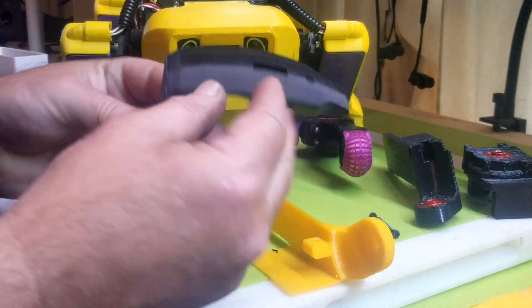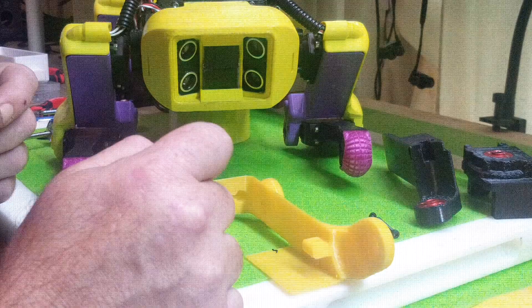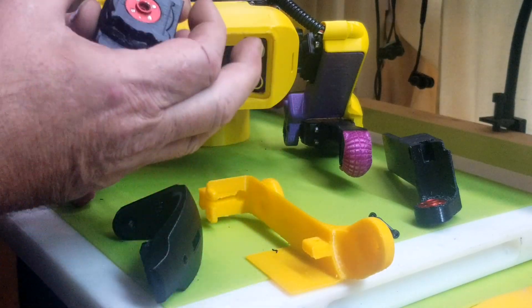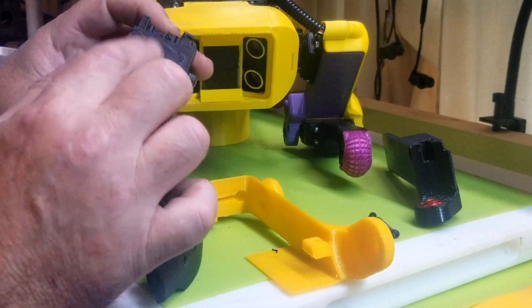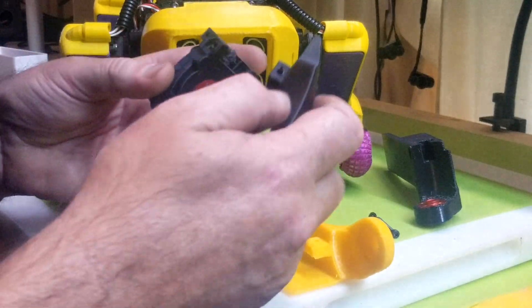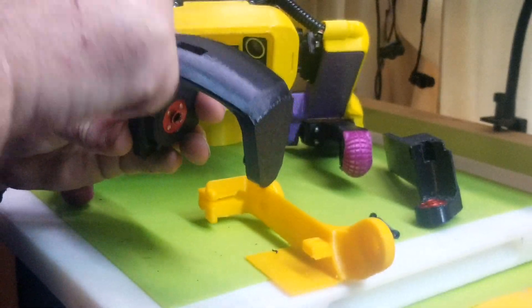There is another shoulder design out there that Eric Ninja over on Discord put together, and that looks pretty cool too — it uses bigger bearings. He modified this piece here to hold a bigger bearing, which takes most of the weight. In my case, I didn't modify this joint here except to modify this little pocket with a couple of screw holes, which takes this tab on our shoulder that just fits in like that — throw a bolt through there and a bolt through there.